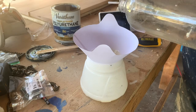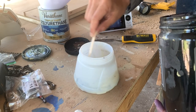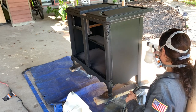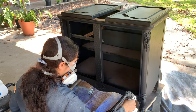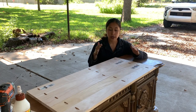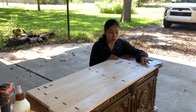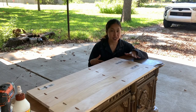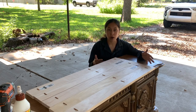So as not to waste any time, I went ahead and prepped my polyurethane for the sprayer — I tinted it using the same black color and watered it down as well. I've got all of my boards here with pocket holes and I'm ready to glue them together and secure them for the new top. I'm going to glue every side, clamp them together, and secure them with pocket holes. Let's get started.